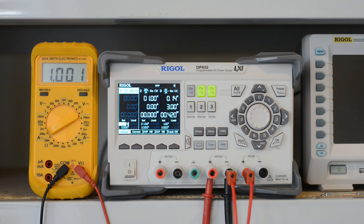It's worth keeping the bug in context. At 3 amps, you're generally going to drop a lot more voltage on your supply cables than the error introduced by this bug. But at the end of the day, the PSU is performing outside of spec, and this will confuse some fraction of users. So hopefully this will be the last supply from Rigol to have this bug. Thanks for watching.